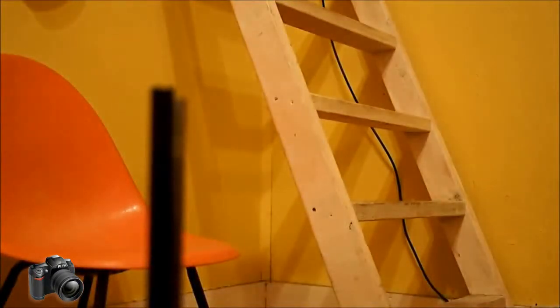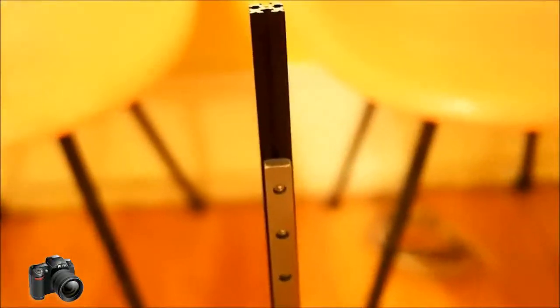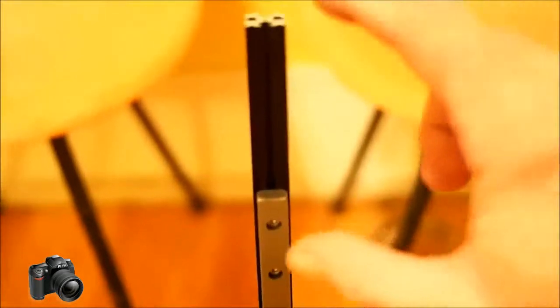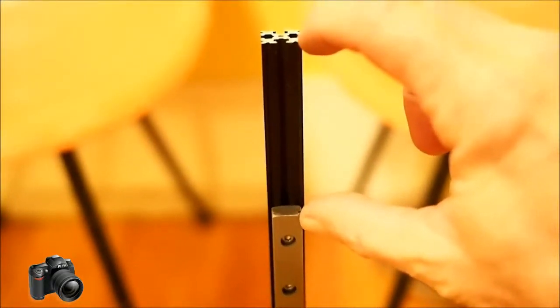Alright, so, okay. Now we've successfully gotten this all the way down onto the rail. Now we've successfully slid this rail down onto the open beam. We need to set where it sits before we tighten it down. We do that by taking that space and adjusting it to 70 millimeters exactly.